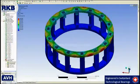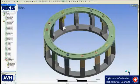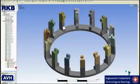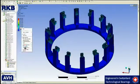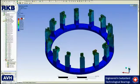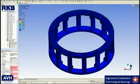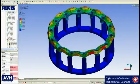In the second case, the AVH structure presents a maximum deformation of 0.035 mm and of just 0.040 mm in the closing elements. Again, to emphasize the behavior of the structure, the deformation results were magnified. By applying the force to the system, the cage cover will present a smaller deformation because the geometry of the components is different, applying a lower bending moment to the structure.